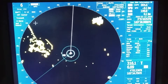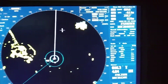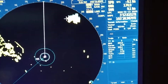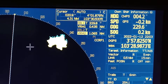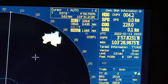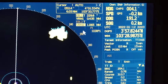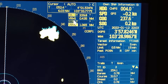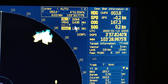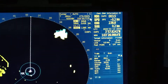I am telling you the useful and common things required for general knowledge. With the cursor you can get information such as true bearing, range, and position. From here you can also see EBL 1, EBL 2, VRM 1, and VRM 2 details.